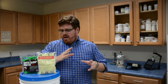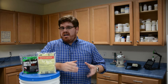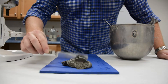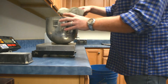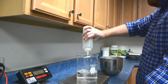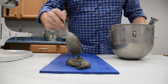I'm going to show you how using our products can give you the ability to quickly and easily change the slump of your concrete on site without affecting the water-cement ratio. First, let's look at going from a dry concrete mix to a wet concrete mix. We're going to mix up about 1500 grams of cement and 1500 grams of sand, along with 525 grams of water. This will give us a dry mix with a 0.35 water-cement ratio.